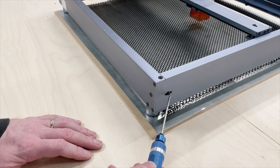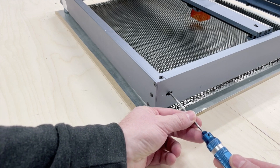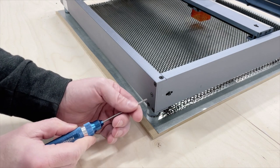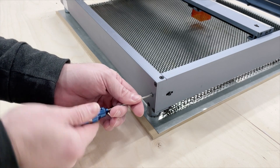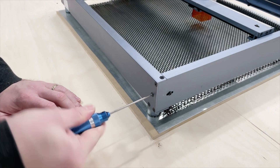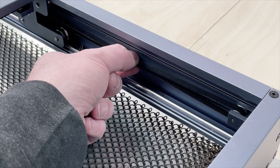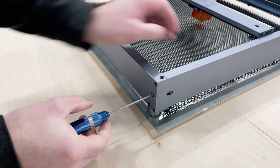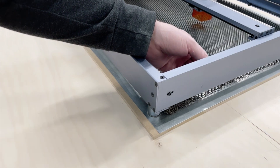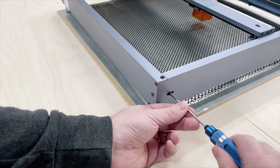The next tip is you want to make sure your belt tension is proper. There are two steps here: you've got the side screw that locks the block in place holding onto the belt, and then you've got the adjustment screw on back that if you tighten or loosen it, it will slide that block back and forth, adding or removing tension from the belt. You want to check the belts to make sure they're tensioned properly — not too tight causing binding, but not too loose that they'd be skipping teeth. Try to get your two side belts equal, then lock them all in place.